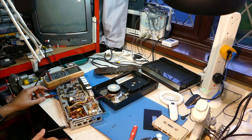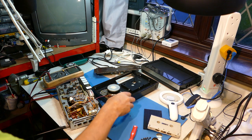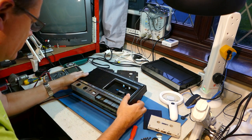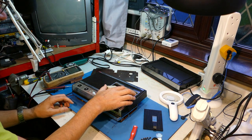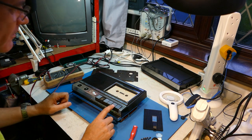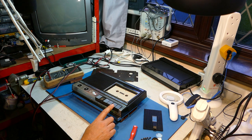Nothing happened. I think that's a good thing. I'm just going to turn this around — I'll switch the power supply off for a second. I'll put this on because it's quite hard to know what button does what. It's quite hard to know even when they are marked up on Grundig, but even harder when they're not marked up. So let's briefly put that back on. We'll start with fast forward. It's non-latching. Nothing. It went straight into over-current position. A bit more current. It's trying to take an amp. Too much, surely.